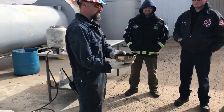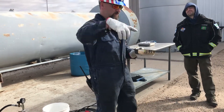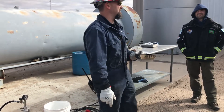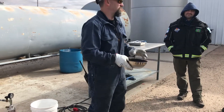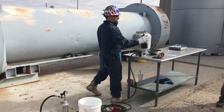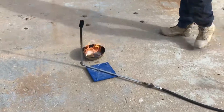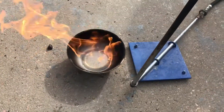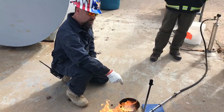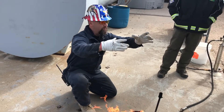Nobody considers that it takes energy to cause propane to vaporize - it wants to stay a liquid because it's already been turned into one. The railroad tells us about this all the time: after wreck operations with tracks reopened and hazmat cleared, they'll pull a propane car out of a divot and find a big puddle of propane underneath it three or four days later, even at 80 degrees outside. We try to recover the material and burn it off - just burn it off. That brings me to liquid flare, which is just lighting liquid on fire. You run a hose out to a pit and set it on fire.